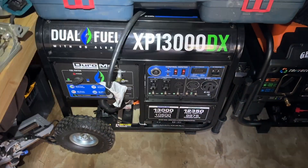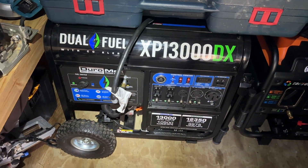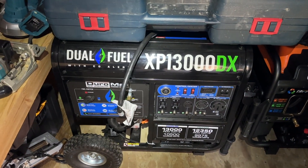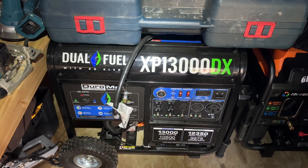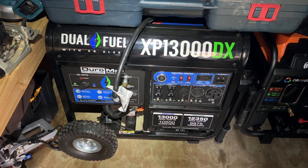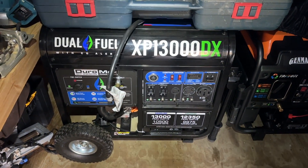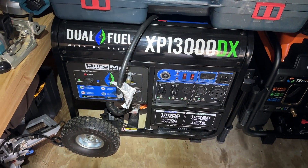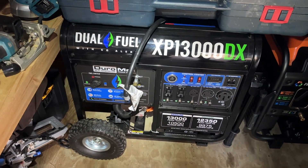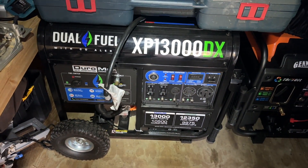The point of the video — I'm not trying to bash the Duromax because this thing got me through Hurricane Milton for the last two days. I don't want to blame it, but I did have a refrigerator failure pretty much right after Milton, and that could have been from lightning or whatever. But the total harmonic distortion on this generator — and I love this generator — it will not allow power coming in from it into any of the EcoFlow stuff. It's got very high total harmonic distortion. I kind of hate that they sell this as a whole home backup power solution, because people don't understand that the THD value should be printed right on the front of it. Everything nowadays has a microprocessor or sensitive electronics plugged into your house, and if you're powering a panel or transfer switch with one of these things and don't know that, you're doing damage and don't even know it.